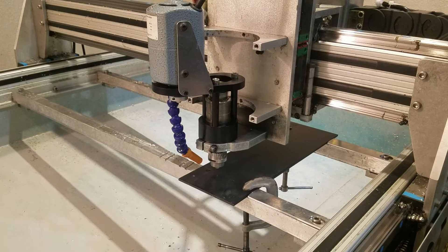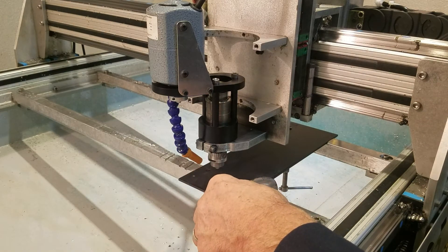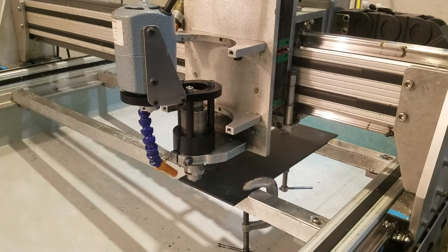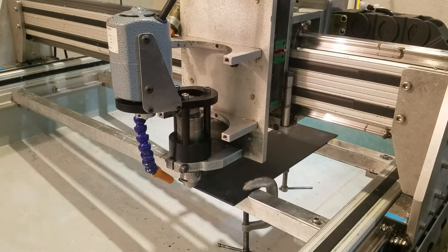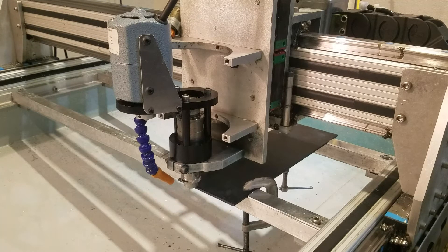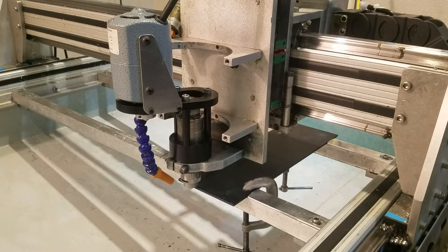I'm going to move it to retract level and set the X and Y work zero independently. I'm going to use the quarter-inch diameter nose and touch the edge to determine the X axis. The work zero should be at this corner of the material. I've moved it rapidly with the four key and I'm switching to the mouse wheel. Moving down and looking at the edge so I can see when there's a gap, then switching to the X axis — now it is just exactly touching. I hit the X key, it brings up the X axis control, and since we're in engraved mode it nominates minus 0.125 as the coordinates. I click set as listed, so now my X work zero is set.